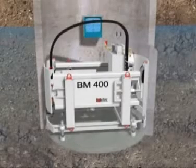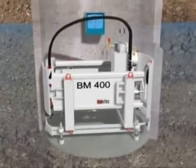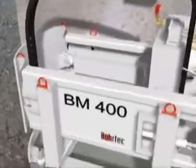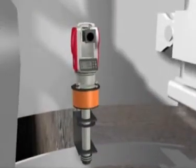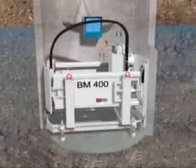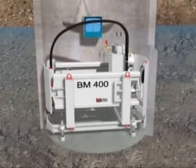After the machine is set up, the guidance system is installed. The Theodolite with its electronic camera is mounted on a height-adjustable support, independent of the machine. The Theodolite is set to the required height, grade and direction. A monitor screen fixed onto the wall of the shaft allows the operator to view the target through the Theodolite-mounted camera during the piloting operation.